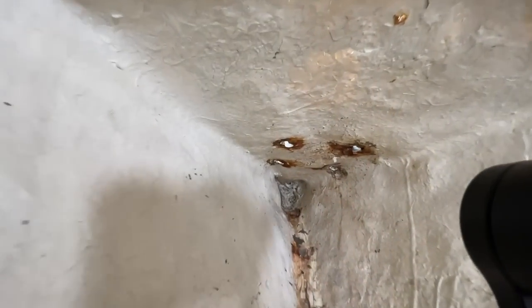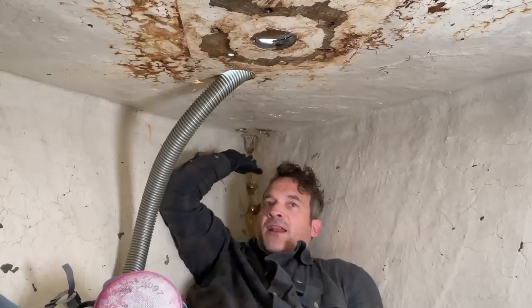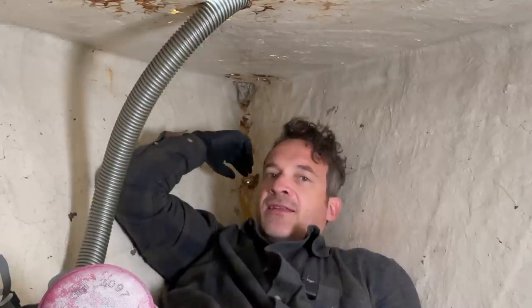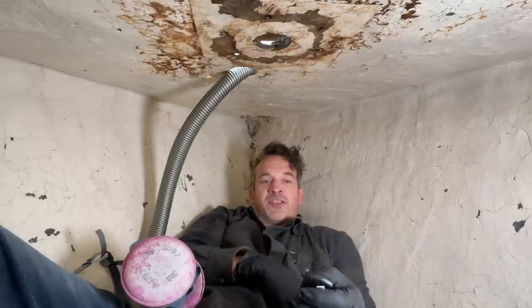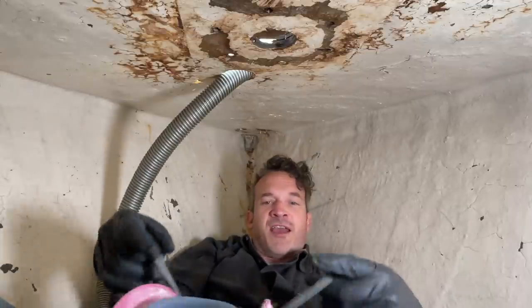So this would be the area where we're going to be cutting in a little bit, but we don't want to do a lot of damage in here — I want to be able to fix it pretty easily. What I've decided to do is drill some holes up around the perimeter of where the glass is laid up inside here. That way when I'm cutting from on top or removing layers, I'm not going to be risking cutting into the hull laminate. We'll drill some holes to make sure we know where we're going. I'm going to run the vacuum to keep it clean. If I look comfortable, it's because I really am.